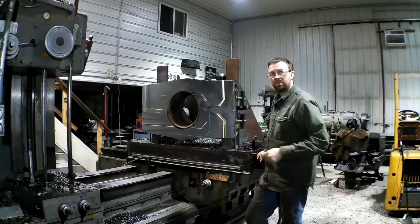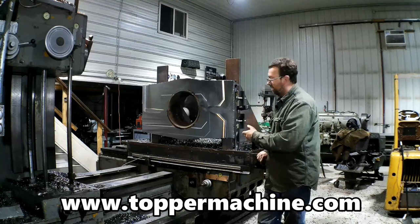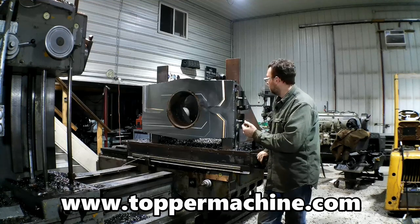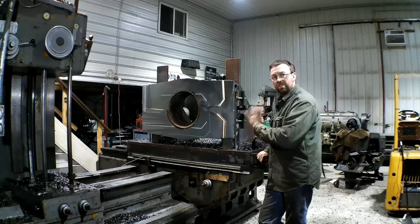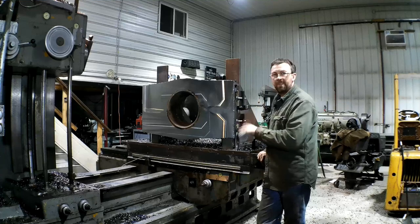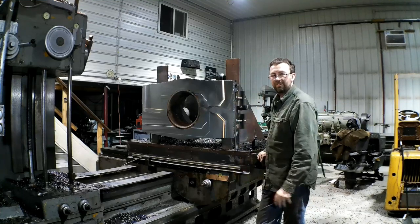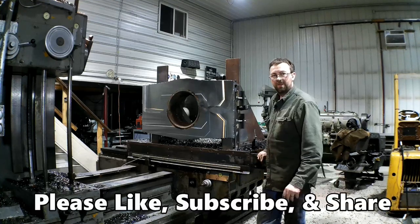There you have it, the truck bolster for the Mark Twain Zephyr. Started out as a flame cut piece out of a NW2 locomotive that got scrapped, 4 inches thick. In all total, we took about 1,000 pounds of material off of this thing between torching and milling, all with the horizontal boring mill with a CNMG insert and a homemade fly cutter. Worked beautifully, did the job perfectly.